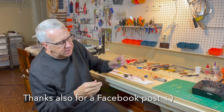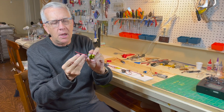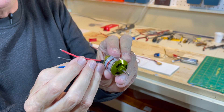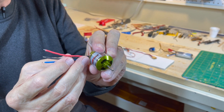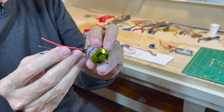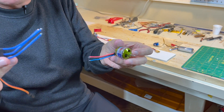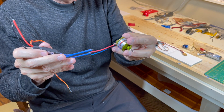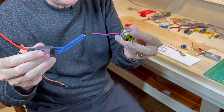The other part of this discussion is a typical brushless motor. This is one of our wonderful brushless motors. Again, we have three wires that go out of the motor. The reason there are three wires is there has to be connectivity for the magic of the electronic speed control electronics to tell the motor how to rotate when the fields go off and on, because it is brushless. Here's the electronic speed control, here's the motor, the three wires connect. Notice there's no relation on the colors between the ESC and the motor — they can be a wide range of colors, it just doesn't matter.